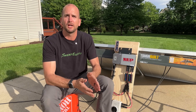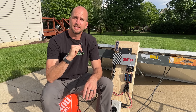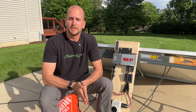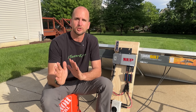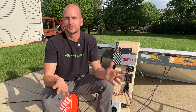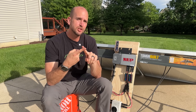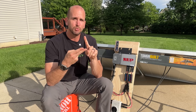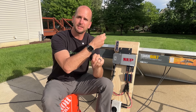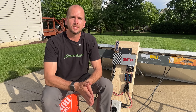If you want to go further, they can help you get local installer quotes. For this plug-and-play setup, I'll also have a link in the description — this is my favorite plug-and-play on the market. Everything else is kind of cheap Amazon units where you don't know the certifications. The one I tested before burned out in two days with tons of similar reviews. Check with your local electrical inspector — mine is okay with this because it has UL-1741. My utility is okay with it, though I can't get net metering. Also check with your HOA if applicable, as some ground-mounted systems aren't approved.